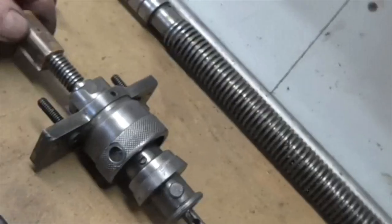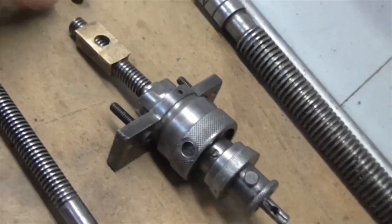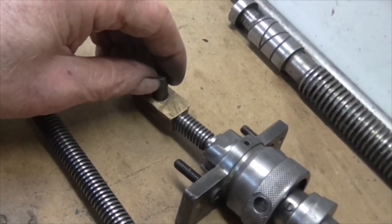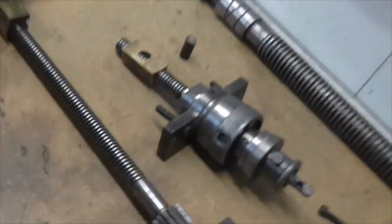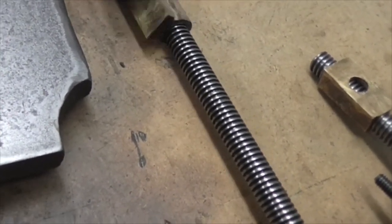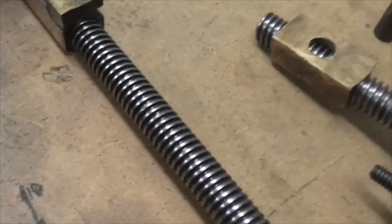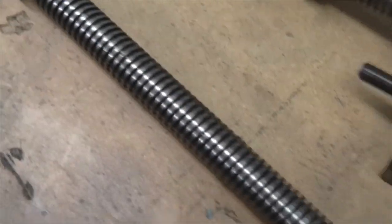The pin which locates this nut in the top slide has quite a lot of play in it, which I don't want, but that can easily be rectified. One part has what looks like a modern countersunk allen screw and a piece soldered on. The thread is a little bit rounded in the middle but not seriously, so I'm willing to go with it until I prove it otherwise.